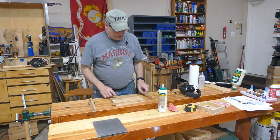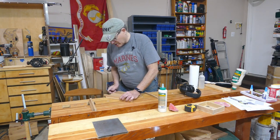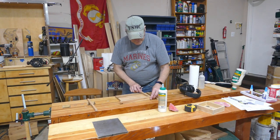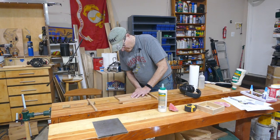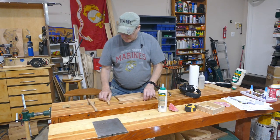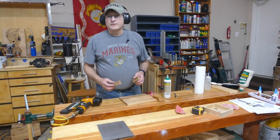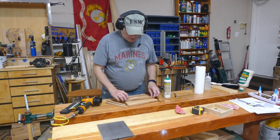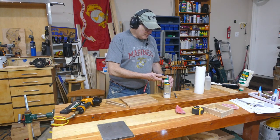Let's first get the right dimensions. All I'm doing here is evening it up and I'll just mark it off the bottom, and then the same thing with the sides — or these end pieces. So now I have these marked off. I will cut them up. Now that I have the rails all trimmed up to the appropriate size, all I'm going to do is spread some glue on them, glue them down, and actually nail these down as well as clamp them — clamp them in place and then nail them.